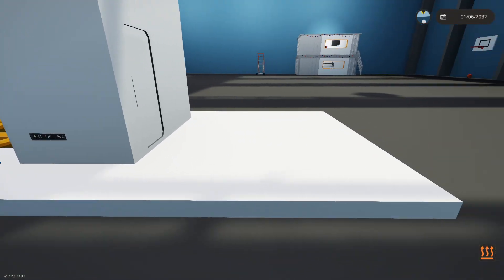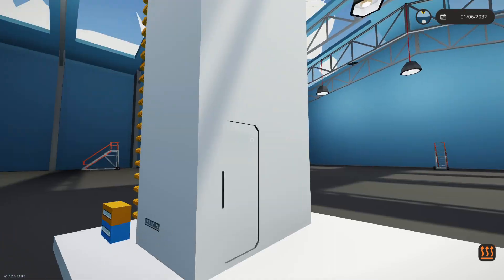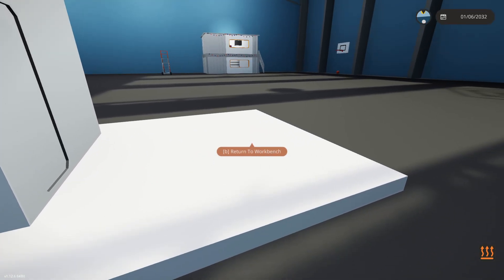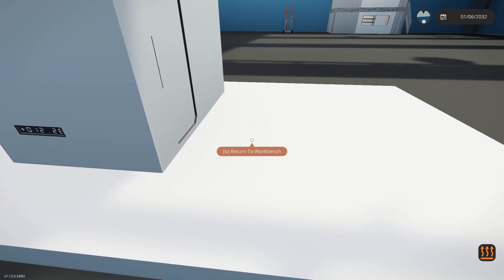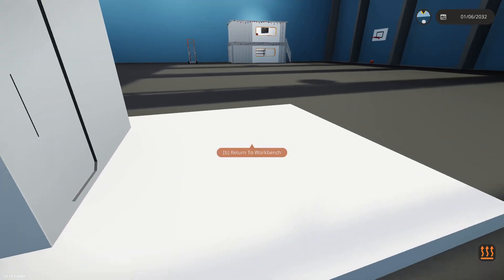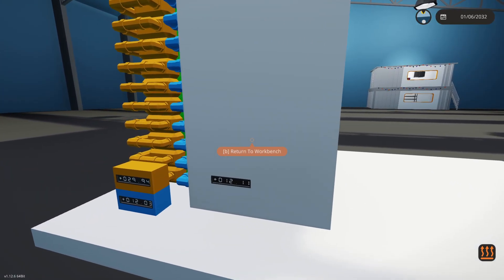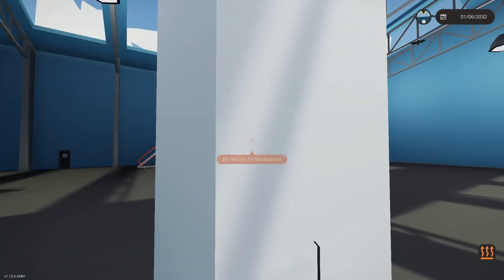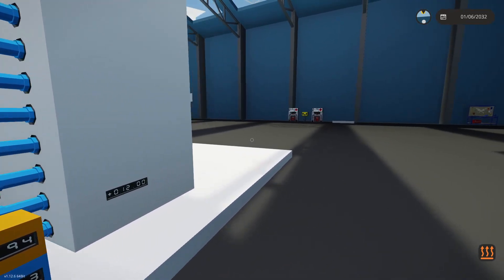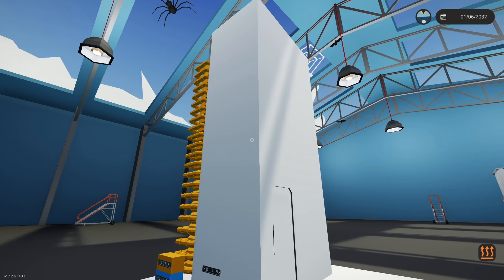Like a dry hatch or a separation room - when you go diving they have a little separation room. You see it in northern houses too: the front door opens into an area for coats and shoes, then you open the door to the main house. It keeps cold air from coming in and out, and any cold air that does escape gets trapped in that room and has a chance to go back in. So there it is - we've made a giant walk-in cooler and done extensive testing on the cryo part today.